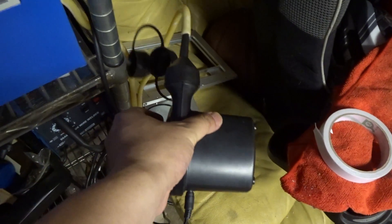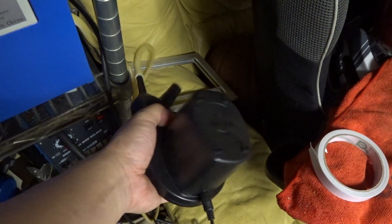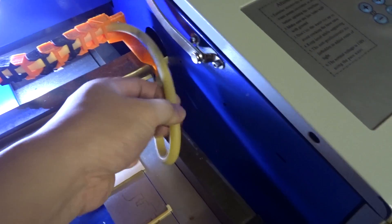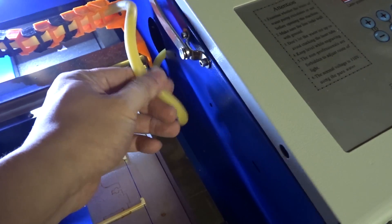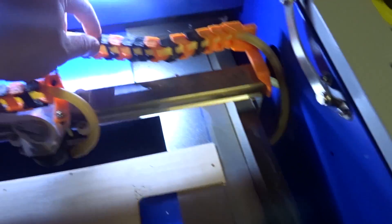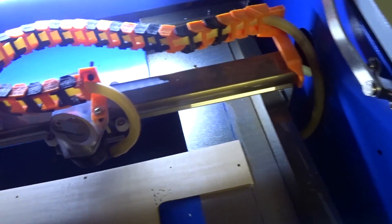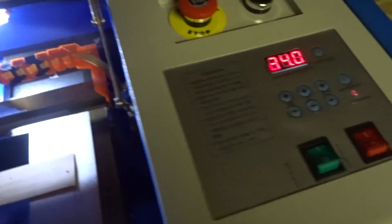If you leave this on for a very long time without the fan it will spark up a flame, and you need to blow it out before it gets worse — so you definitely need this air assist. This is all 3D printed — it's a 3D printed cable chain for wires, but I just ran the tube through it. I used one of those air pumps for inflating an air bed — I'll leave a link in the description. The tube is from Home Depot; it's like an IV-type elastic tube, very flexible.